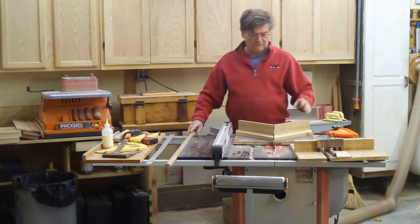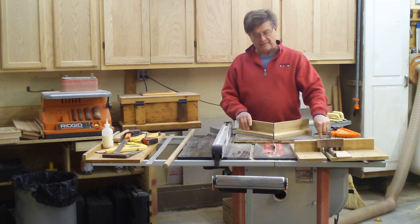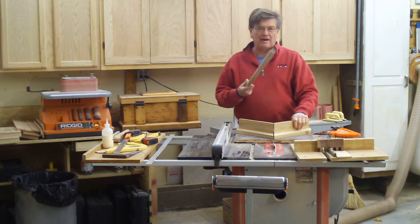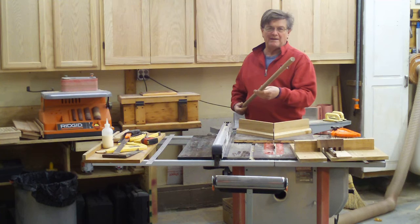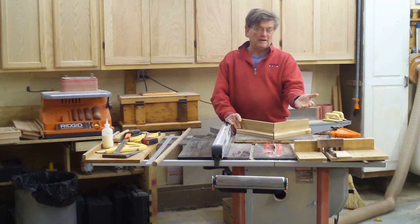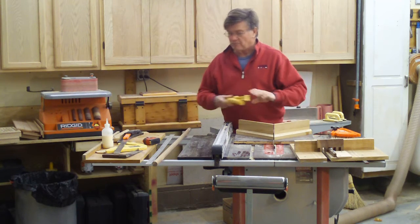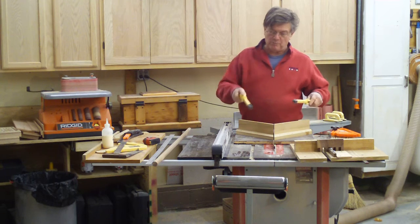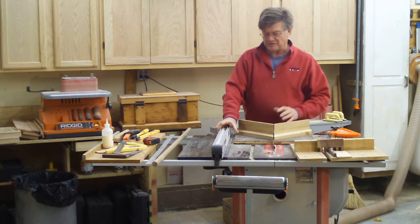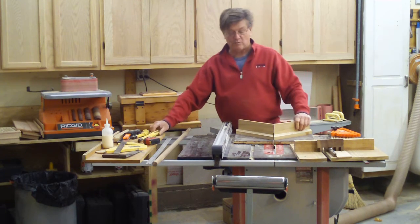If you get on YouTube and look, there are so many things you can make with a saw. I've seen a guy place a pin down and cut a circular table top out of the table saw. I've seen another guy take a square piece of stock and make his own dowel rods. There are many things you can do with this piece of equipment — it tilts to any angle you want to make angle cuts. You can also buy all sorts of items to help you push the material through the blade. Don't use your hands. On a real wide piece you can if you're far enough from the blade, but if you're cutting something one inch wide, push it through — keep your hand away from the blade.